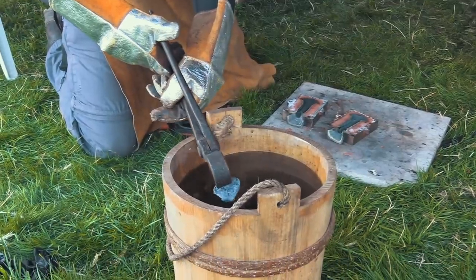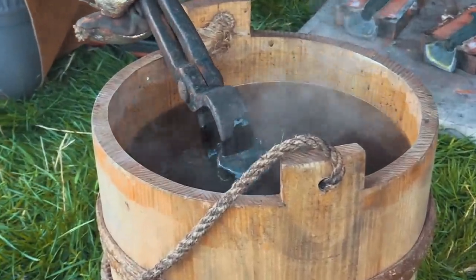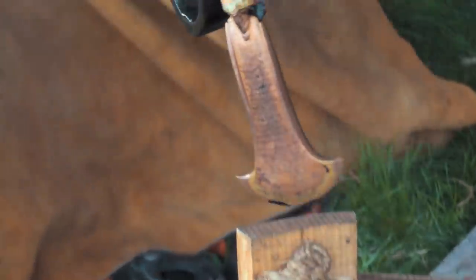And I noticed from filming it that you can open the mould pretty rapidly, really. It does go off really quickly. Yeah, it is solid well, within seconds, and it's a case of when you want to open it, really, whether it's the first couple of seconds and the mould bursts into flames with the oil burning, or whether you're happy to wait and it'll just be still quite hot and needs a good sizzling quench so you can handle it. You don't quench it immediately.